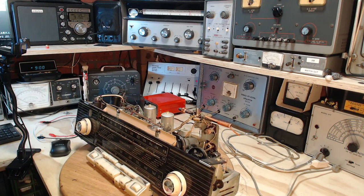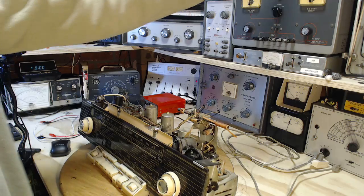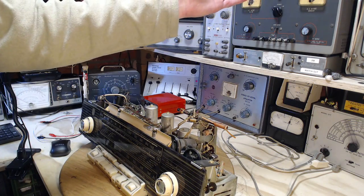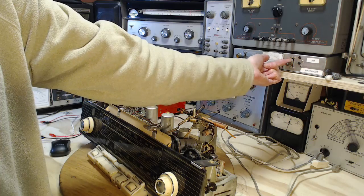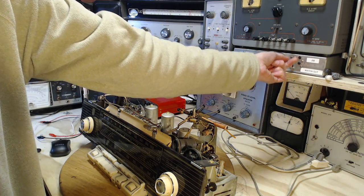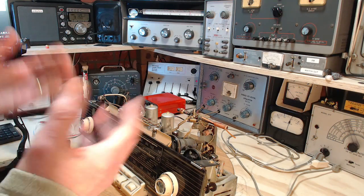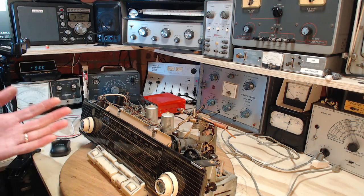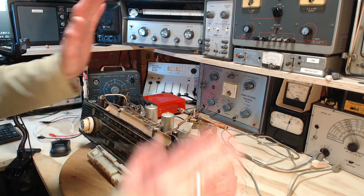One possibility that a buddy of mine actually saw is that when the dim light came on and I reached over to hit this switch to return it to the neutral position, I flicked it up, thereby taking the dim bulb out of the circuit and putting full power on. And that's the moment where the breaker opened. Still doesn't help me explain why it operated. So that's one thing — why did the breaker open?